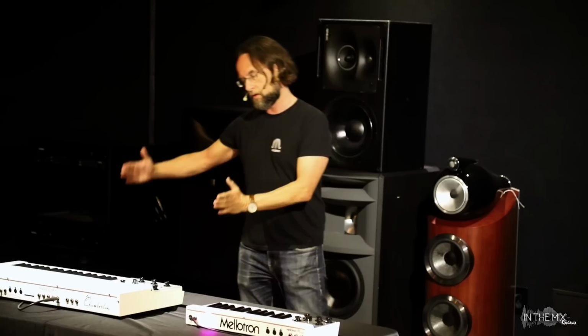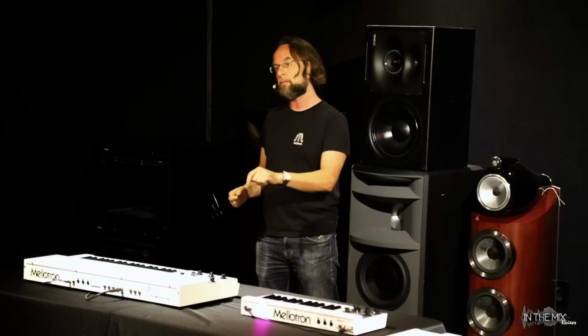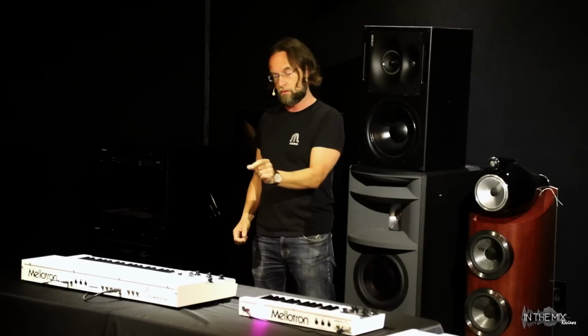So it was quite a complicated machine, because these machines had three-track tapes and a scrolling mechanism. Each unit had 3 times 6 sounds, 18 sounds, and the selection of the three sounds was of course easy. There was a rack of heads underneath the tapes, and you just mechanically moved the heads sideways to the three different tracks. So it was a very straightforward mechanism. You can even mix between adjacent tracks when you put the head just between the two, A and B or B and C, so to say.